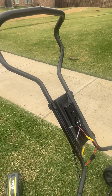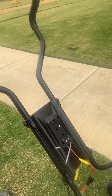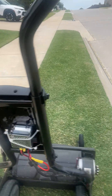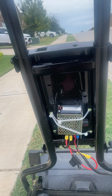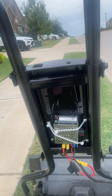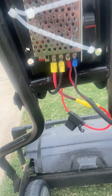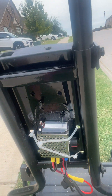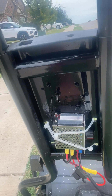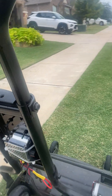I will say this mower's not perfect — it has its idiosyncrasies or quirks. I take the power to a speed controller that, just for simplicity's sake, I've zip-tied back here. It's probably the most important part of your build. I spent a lot of time trying different ones and burning up some. This one has a fuse that comes with it — it's a 30-amp fuse. It's rated 7 to 70 volts, so it handles the 40 volts, but there's a caveat to that, which I'll cover in a second.